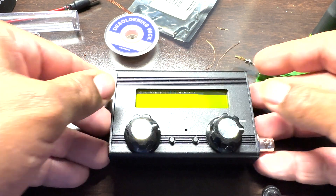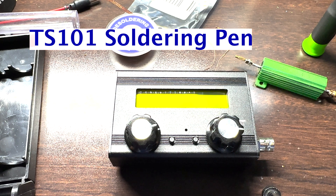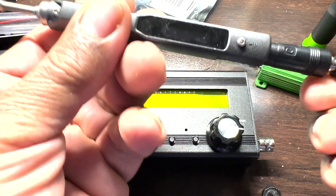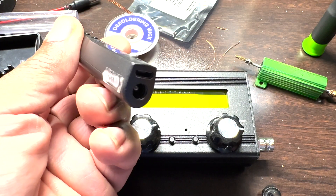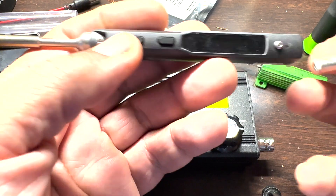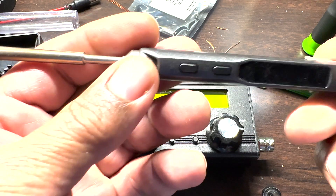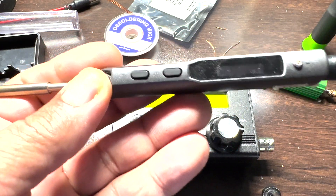Get yourself a fine tip soldering iron. Let's talk about the tools I used — starting with the soldering iron. I use the TS-101 soldering pen. If you hear bad reviews on that thing, someone bad-mouths it, check for yourself. It's a good piece of kit. A DC barrel jack goes in the back, takes 12 to 24 volts, heats up to 400 degrees C, and multiple tips are available. This iron will do the job.